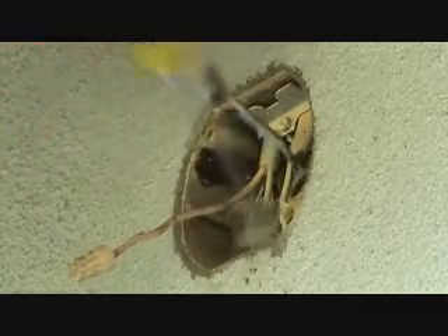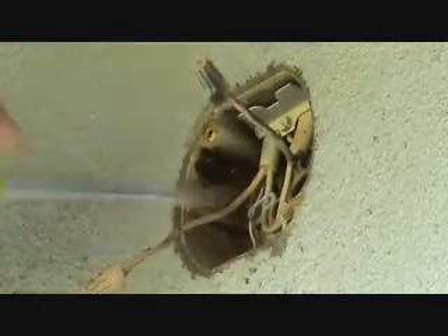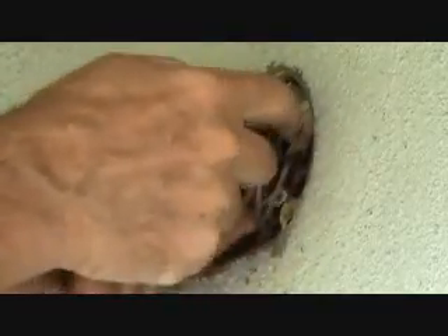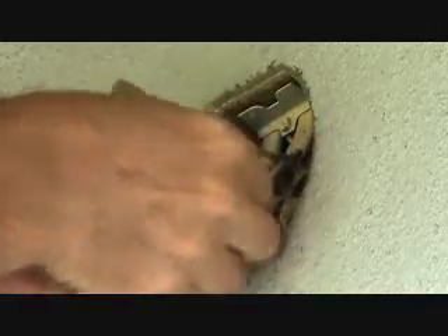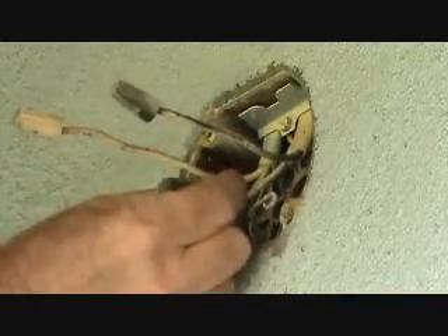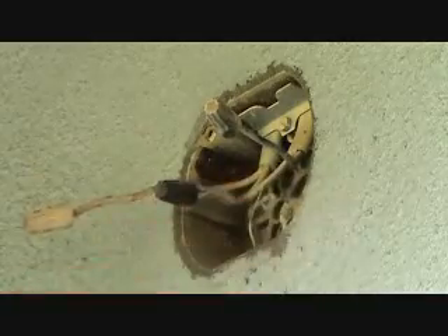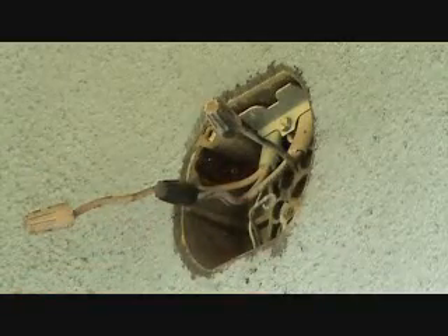Be careful not to scrape off all of your stucco and stuff. It's got some stucco remnants in here so I'm going to clean this box out, and then we'll figure out where these wires go. Right now the power is still on to the box. Got a wire nut on here, a wire nut on here — be careful with that. I've got a wire nut that was in here attaching the white wires together. I've got a black coming out and a black coming out of the box.